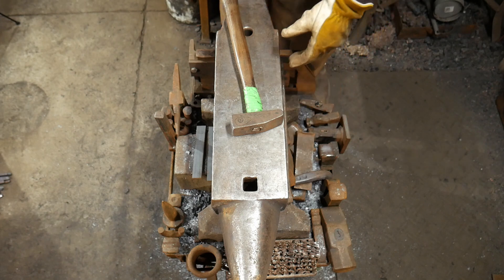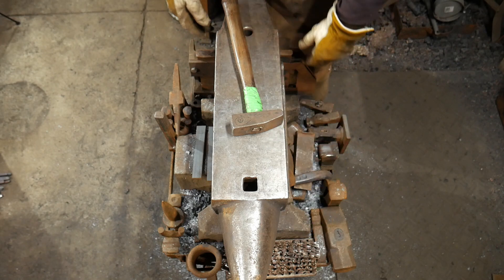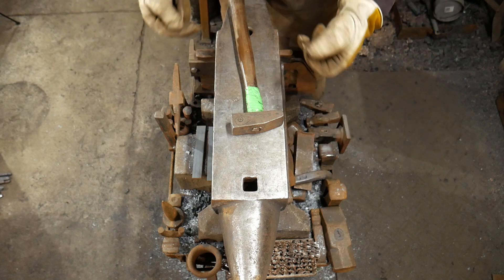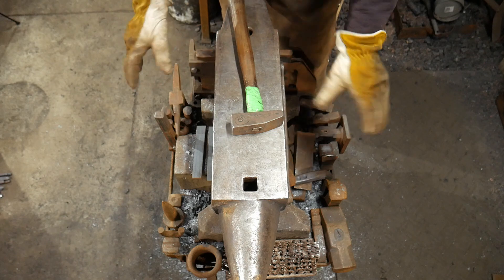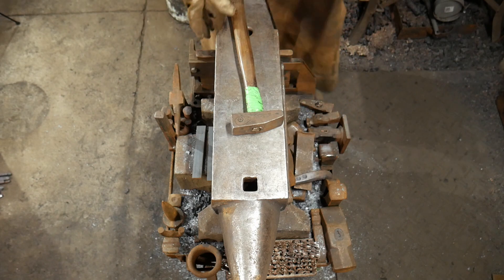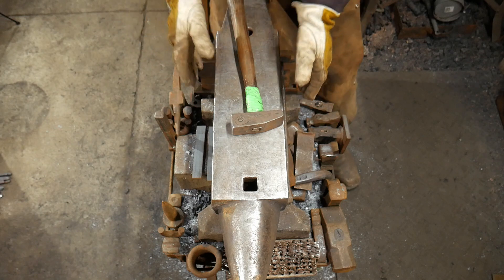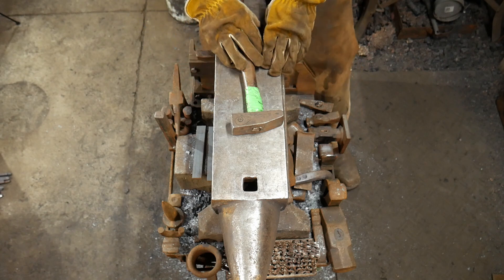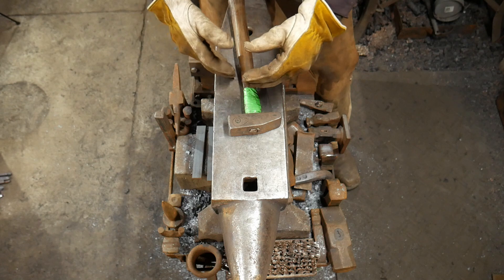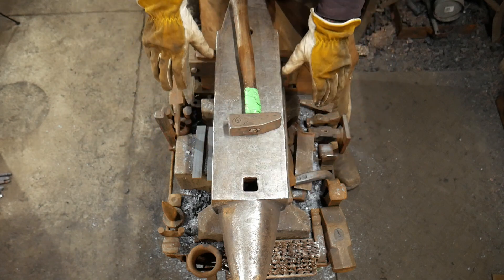Here's a quick bird's eye view of the layout around the anvil — front, back, to my right toward the forge, and to my left away from it. I don't like tools laying on the ground or in buckets; I prefer storage racks or keeping things close at hand. Tong racks on the back wall hold my hammers and specialty tooling. Importantly, don't copy my layout or John Switzer's exactly — adapt what we've shown to your own shop, workflow, and needs.